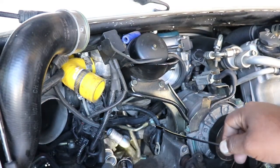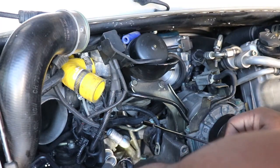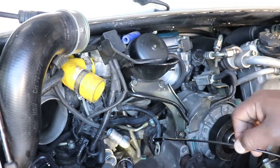All right, so I'm going to use my little wire camera here. We're going to go down and look at the surface again after cleaning, so we can see what we'll be bonding to. And this is what it looks like. Instead of glass smooth, the surface is going to look like this. Okay, this is what it looks like for bonding. Clean and rough. All right, so now we can put the adhesive on and prepare our fitting with the knurling, putting adhesive on both surfaces.